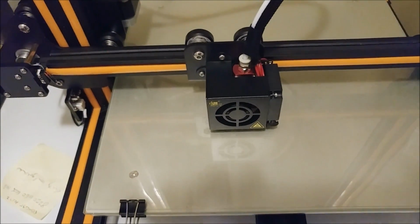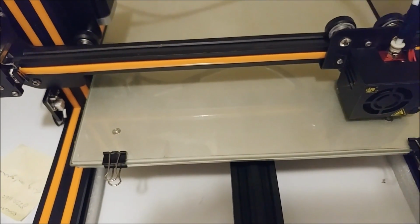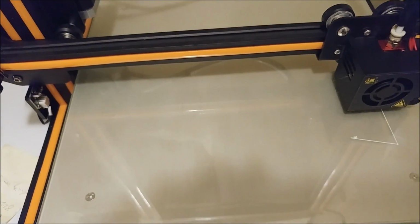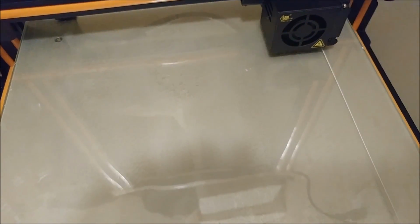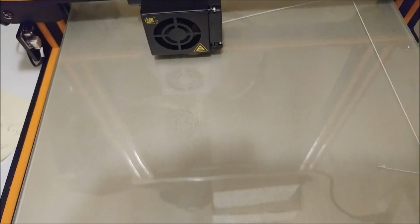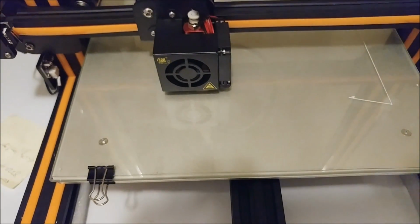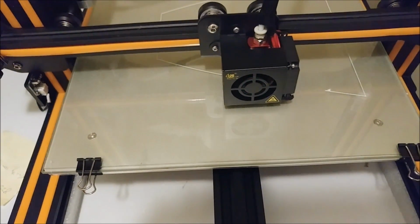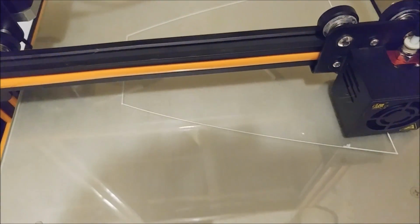I've been experimenting with a 3D printer, trying different things, and now I've decided to print these ribs without having all the support on the inside. So basically flip them up the other way, so they're printed sort of like a cup or a bowl, and they're actually working out really well. That also reduced the print time because it didn't have to print any of the support, and uses less material as well. So the print time now is about 8 to 9 hours instead of about 12 hours for each one.